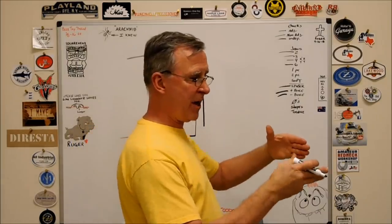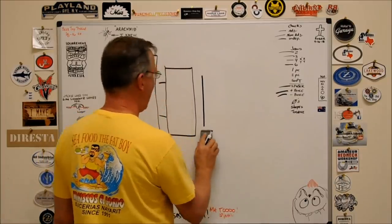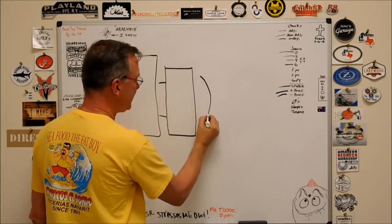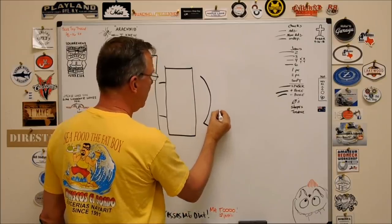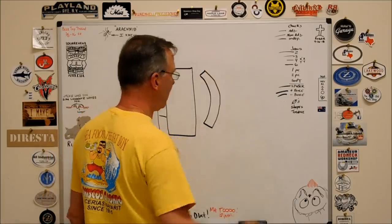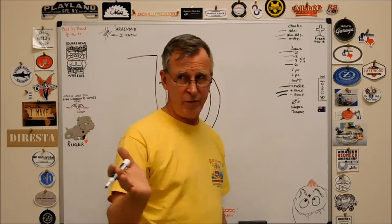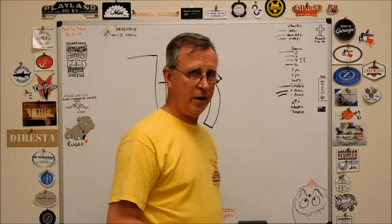It's either going to bulge out or it's going to bulge in. So let's just assume it bulges out. What happens? Well, it bulges out, right? Grossly exaggerated. Here's your part. It's just bulged out because you're squeezing it like there's no tomorrow. There's no reason to over-torque the parts that you put in a lathe. Torque it tight enough to hold it, give it a little snug, you're good.